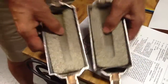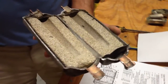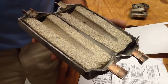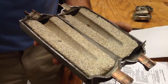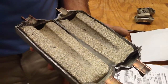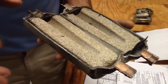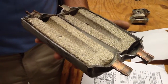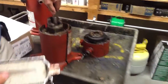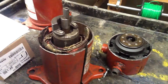What are the reasons for a filter dryer? It's to capture all non-condensibles such as acid, water, and atmospheric air. It's to catch tar, gum, and residue. It's to protect not only the TXVs in the system and the orifices, but it's also to protect this compressor motor — because if the compressor gets contaminants inside of it, it will ruin it.